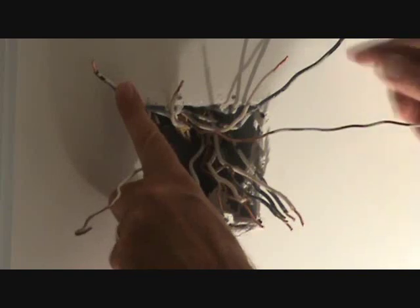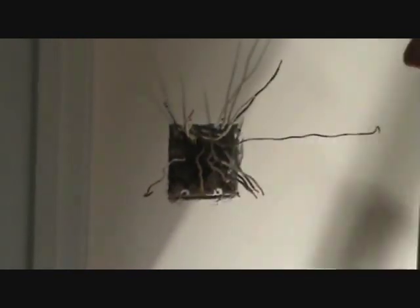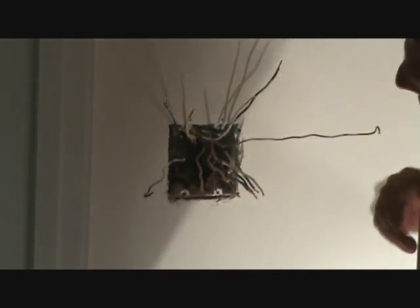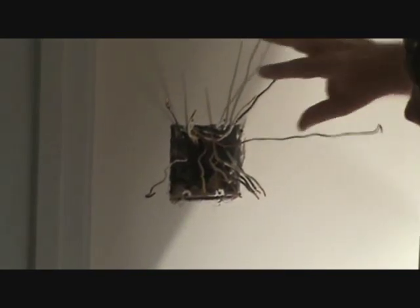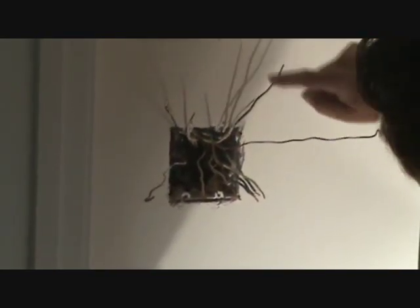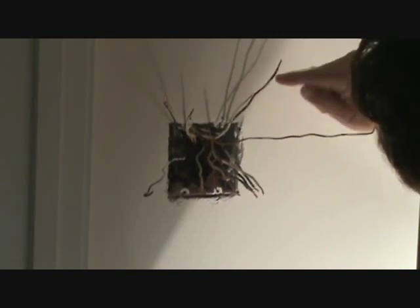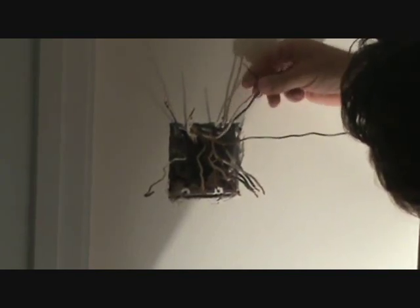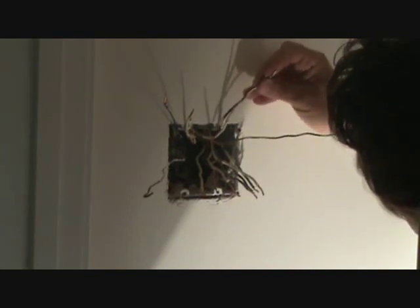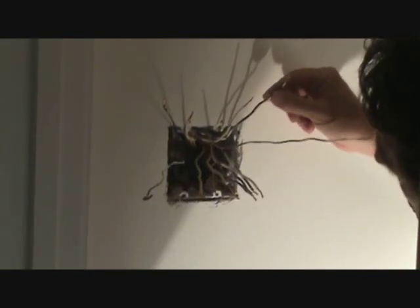Okay, here was the black wire to the left switch, and here was the one to the right switch. What's important to know is when you get wire, usually you get a black wire, a white wire, and a ground wire in one piece of cabling — it's called 12-2, 14-2, whatever. It's important to see where these wires go so that when you get ready to hook all this back up, you know that this is for your left switch and this one is for your right switch. Try to keep track of these wires — you can put a little curl in it, mark it with a felt tip pen, or put a little piece of masking tape on it. We'll put masking tape on these two black wires so that we can identify them when we reinstall the light switches.